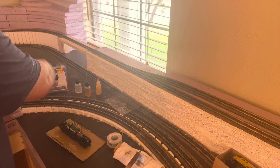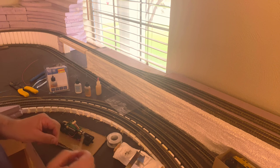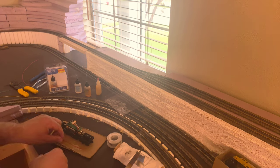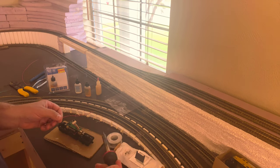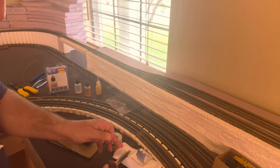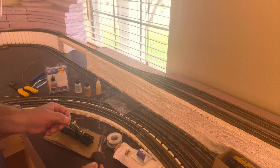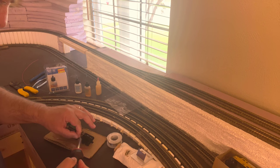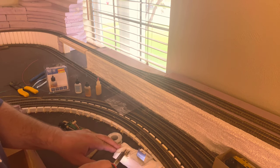The next thing is the other motor wire. I'm going to strip a single wire here and solder this to those metal brackets that run along the top of the trucks. They used to be connected by a metal strip that ran across there and also made contact with the top of the old motor. I'm stripping the ends and also the middle a little bit, and I'm going to tin these and get a little solder on those metal brackets on top of the trucks. This eliminates the need for that metal bar that runs across the top, and you need that space anyway because now there's a circuit board up there and eventually a decoder on top of that.